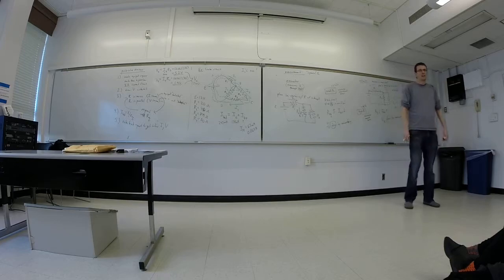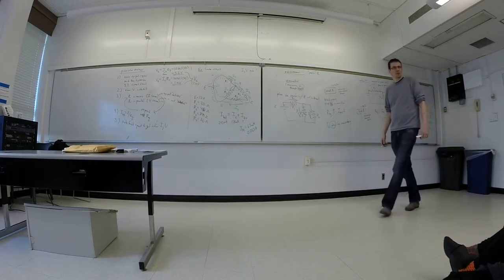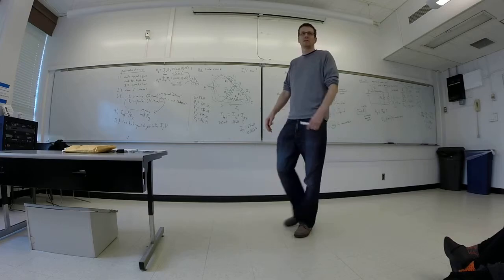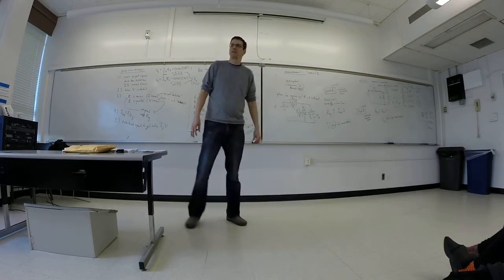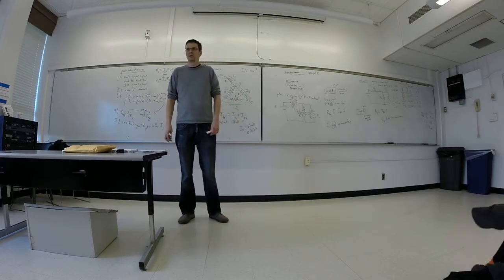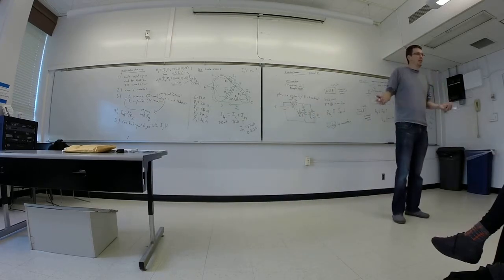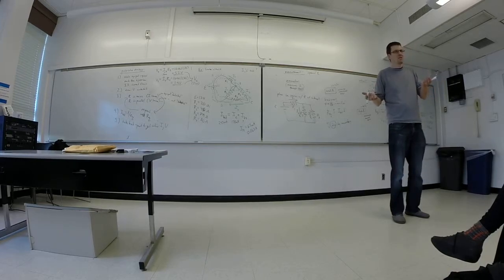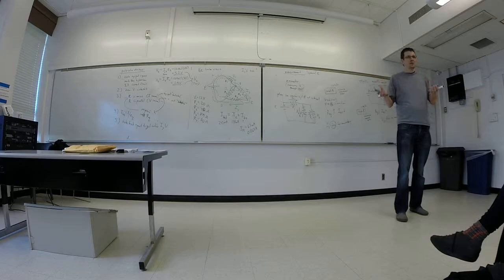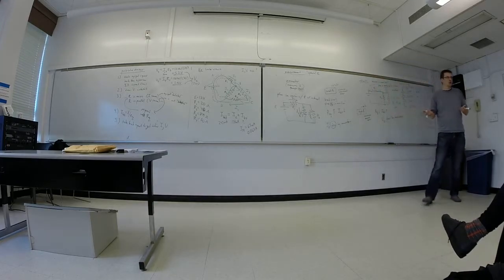Now, that is going to be a massive wrecking ball to your circuit. You're just putting a mega ohm resistor in the main flow. What's going to happen to the total current? Going to go up or down? Down, way down. Basically going to shut it off. You just put in a huge resistor in the main flow. So that's no big deal, because if you've basically shut off the current by putting in some huge resistance in the flow, that at least is not dangerous. It just means that you've basically put a bigger obstruction in the flow than you intended.